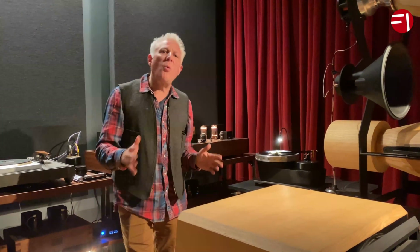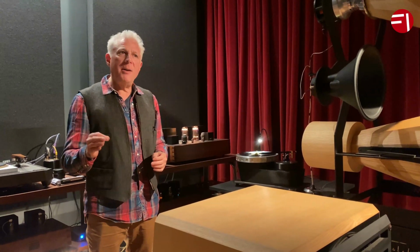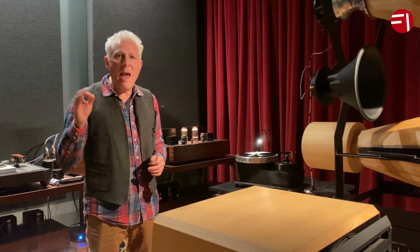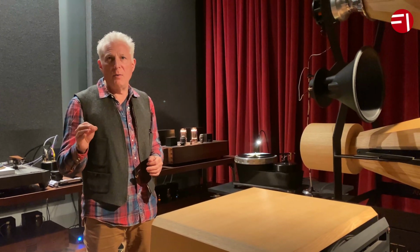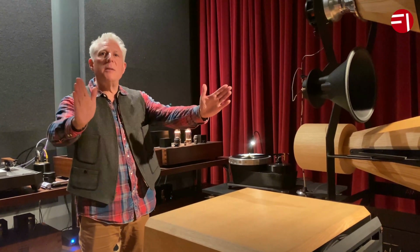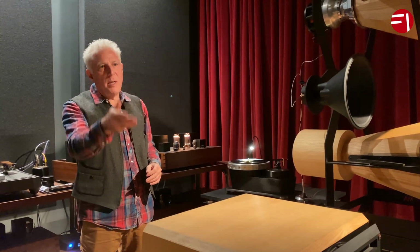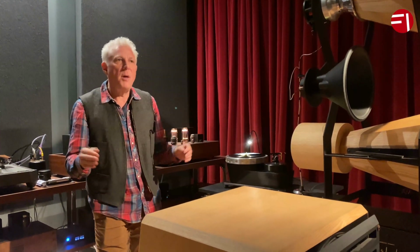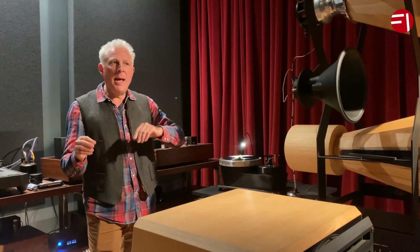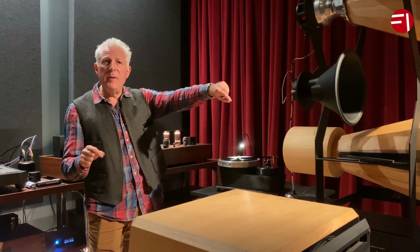We only make conical horn loudspeakers. We're actually the only high-end company that makes conical flare loudspeakers, and we are also the only company ever in high-end to make conical loudspeakers. What that means with a conical speaker is the walls are straight-sided. So you'll see that we have round horns, we have horns that look oval, they're actually a stadium shape, we have squarish horns. They are all conical. You can lay a ruler flat along the side walls of all these horns.